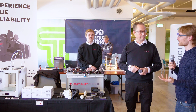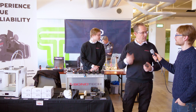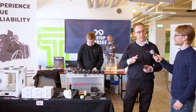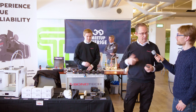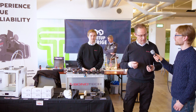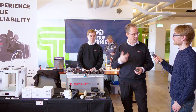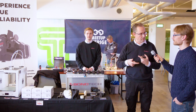You've traditionally made all your extruder bodies with SLS 3D printing as a quick iteration setup. How has that been working out? We have a very good contact with prototype companies here in Sweden that are normally producing prototypes but are also interested in finding production parts, leaning toward small-scale production. It's a fantastic technology because you have full freedom of design, you can iterate fast, and you don't have to invest in an expensive mold. With the latest process, the finish, precision, and strength of the part are really great.